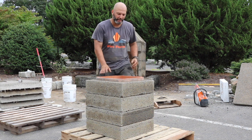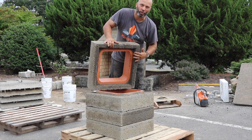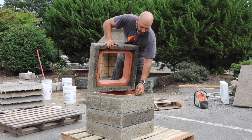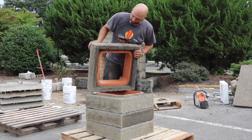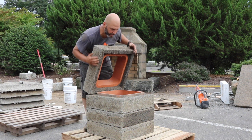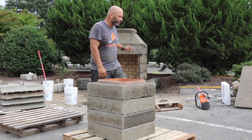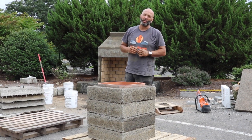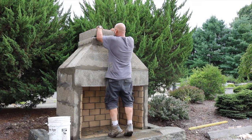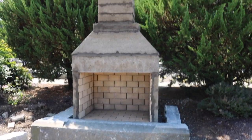It's time to install our flue extensions. They come in six-inch heights and the clay is already fully integrated into the mix. This interlocks with the bottom piece — there's a two-inch inset on one side and about an inch and three-quarter overset on the other to allow for your mortar line. We basically bed our mortar with a dryer mix, a wetter mix along the clay, and place them on top. You can stack these up to about twenty feet high above the reducer plate, giving an overall fireplace height of about twenty-seven feet. Be back with more videos soon — thank you.